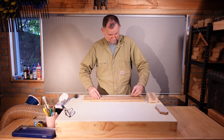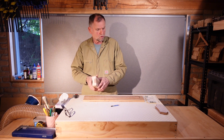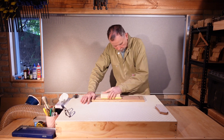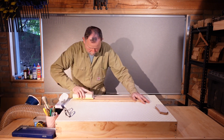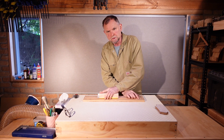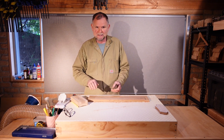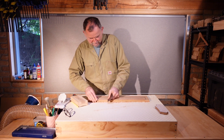I'm drawing a bunch of lines across the faceted fingerboard that we've just drum sanded. I have a radius sanding block — this is 11 inches — and I'm just going to be sanding up and down evenly until all of the lines have gone away. I'm trying to keep the sanding block as parallel as possible, because it ruins the curvature if we swivel it. I'm also helping it along a little bit by using the scraper to take off some wood on those shoals.